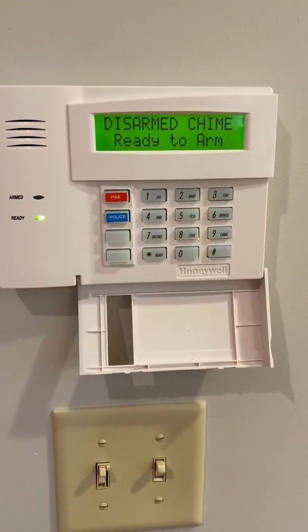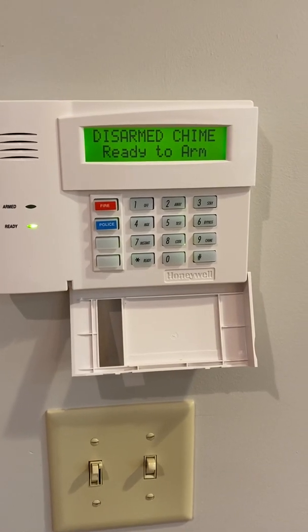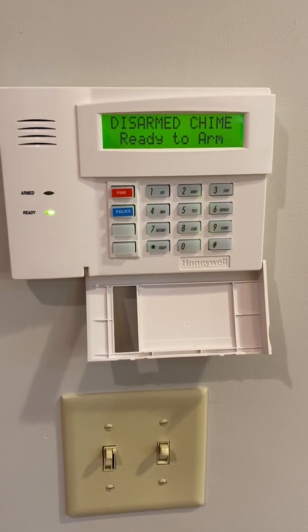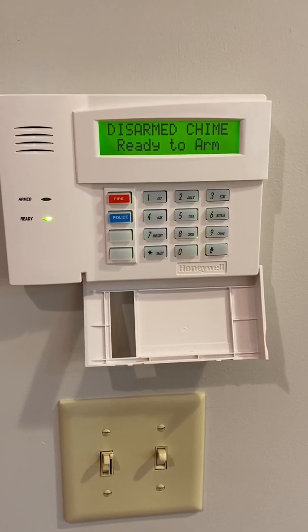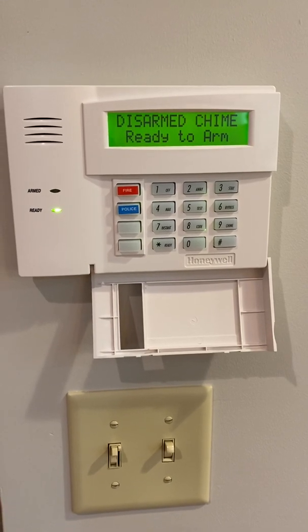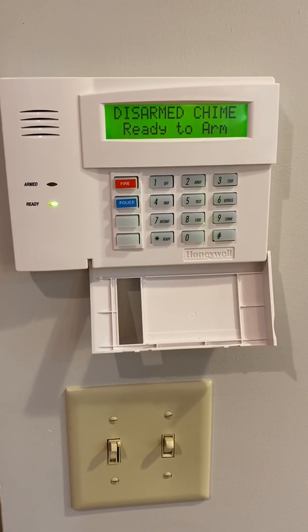Again, let me rephrase that. To change a current master code, you would put in the current master code, press 802, and then enter your new code 2 times. It'll be followed by a beep confirming your new admission to the system.